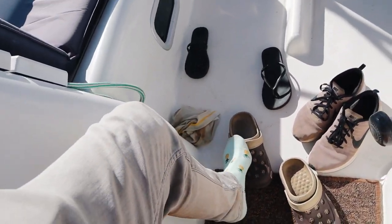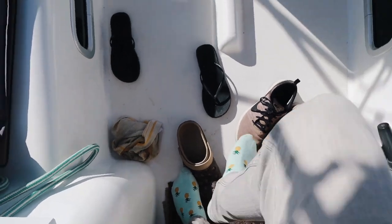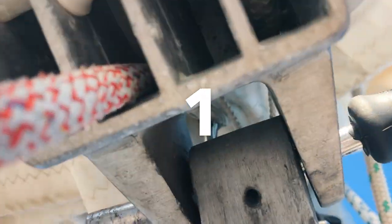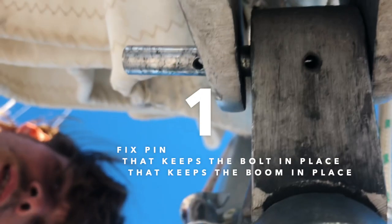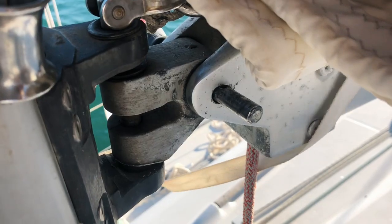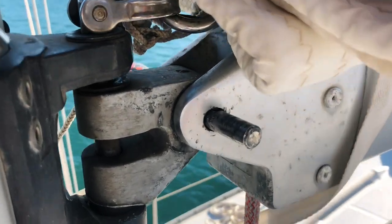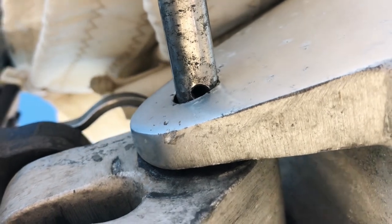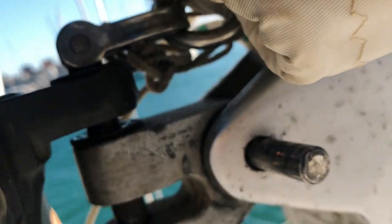Welcome to this year's boat job week — the favorite job week of the year, at least for me. It means one week full of boat jobs; we'll probably include some diving in November. Sometimes I really don't know what's wrong with us not fixing something important right away. This was bothering us for half the season. The gooseneck is the piece that attaches the boom to the mast and enables it to swing around. There's this little pin that keeps the bolt in place, that keeps the boom in place, and it broke. So as we were sailing, the bolt started to wiggle its way out halfway and that twisted the gooseneck quite regularly.